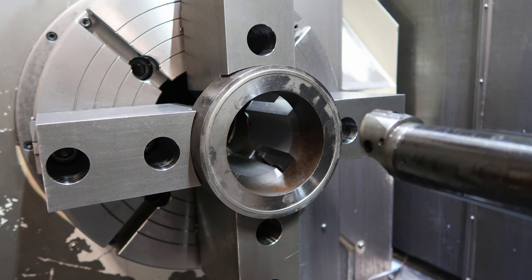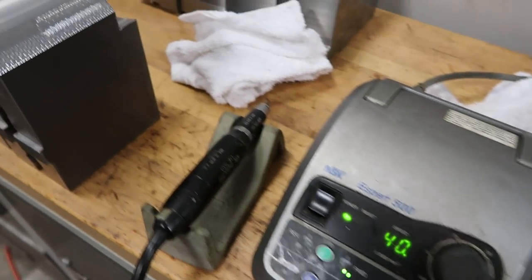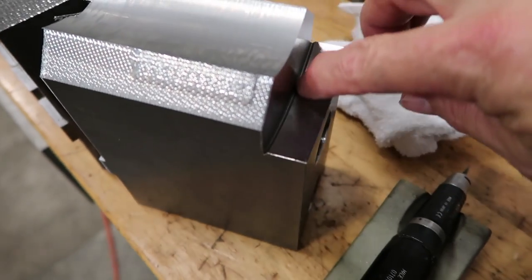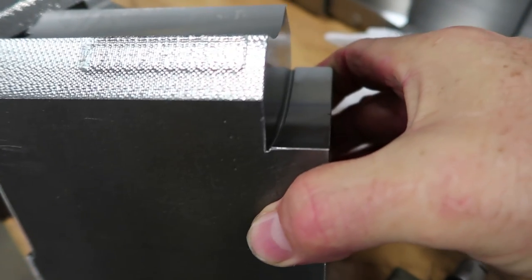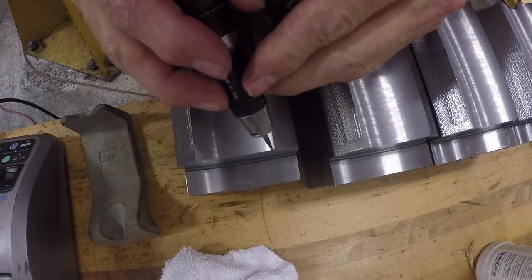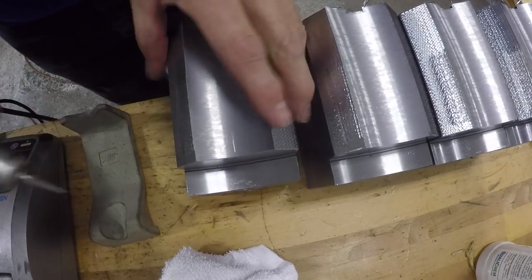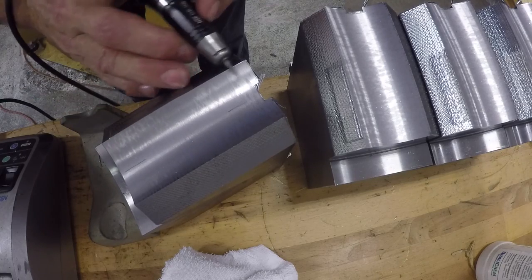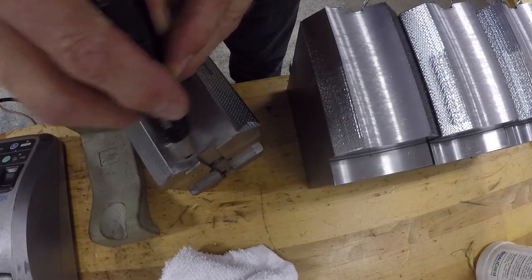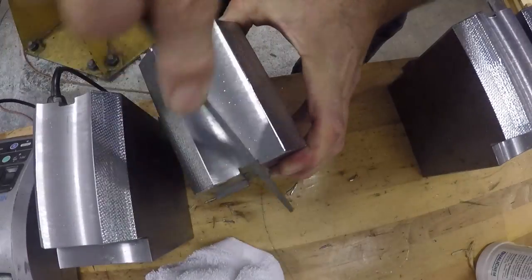Here's a picture showing the piece of pipe I clamped in the counter bore and then I manually bored the jaws. Here I'm just putting a relief in the corner because the parts are just saw cut and have a sharp edge and the insert had a radius from the boring bar previous to this. So I just want to get rid of that radius in the corner of each jaw. I manually did that. Now here's the picture of where I bored the ID of the jaws for the second operation, although I didn't unfortunately take any video of this. There are photos of it, and then I took the jaws off and deburred them with a little pencil grinder.